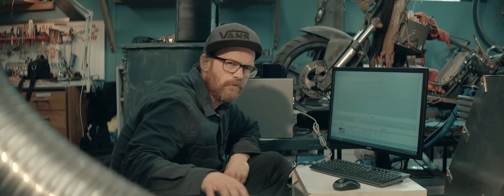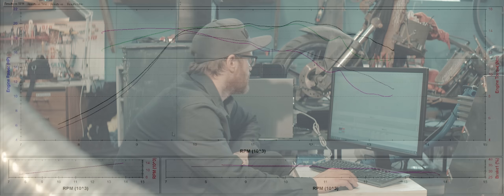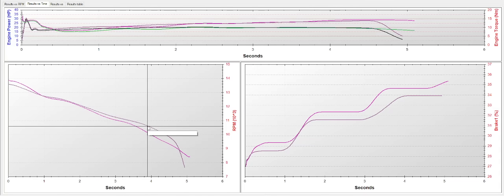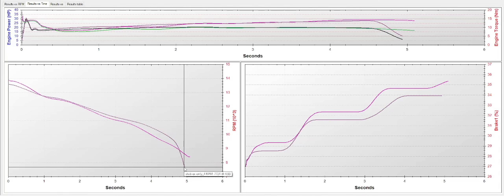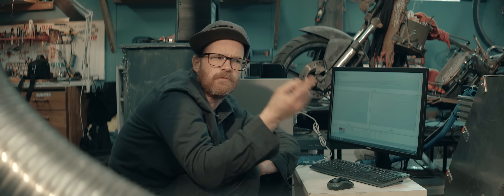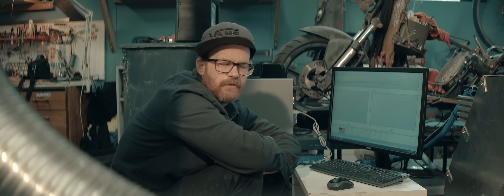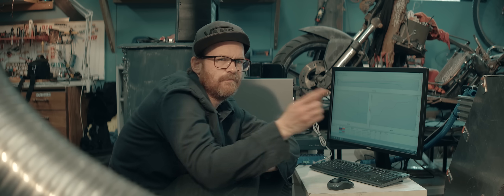Hard to tell during the run — I'll have to watch back the footage — but I think spark current was dropping on the last run there when it plummeted. You can see how this line is linear, and here's the last run which started plummeting. You can see it suddenly dropped from 9,500 rpm down to 7,500 in a split second. This was the last of four runs — might be the plug getting wet. So far we haven't really gotten anywhere with the megaphone — more research required. I want to try higher compression first. I'll machine up a couple of heads with higher compression and we'll see how that works. It's likely we also need to strengthen spark somehow. Next time — see you next time.